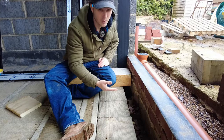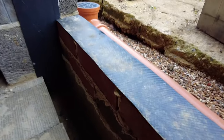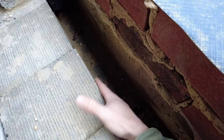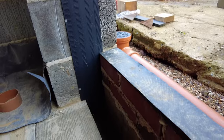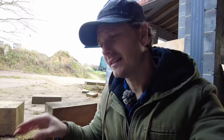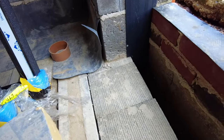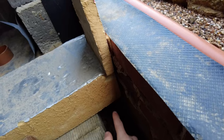Let's talk you through the situation, why there's a problem in the first place, what the possible resolve is but also why that might not actually be the answer. On the outer skin, you've got your damp course there. Down here, you've also got a damp course and that's where your blocks and beams sit on, and then they've cut it back to here and you're left with this gap here. That is the cavity closer on the end. There's no cavity closer here because there's no inner block. You could possibly brick this up and then put a cavity closer in there, but I don't think that's the right thing with the block and beam floor. You could then pop a cavity closer down the bottom which would resolve part of the issue, but I don't think that really works. So my insulation needs to go on here and then there's a gap underneath. If you can imagine that and then you'll have your perimeter insulation which is normally 25mm, so there's just a void underneath there.